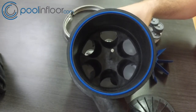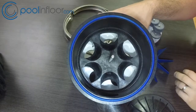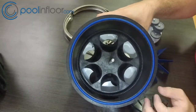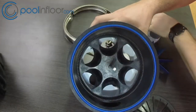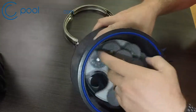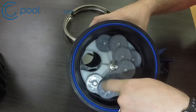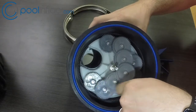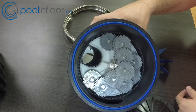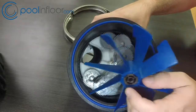It's pretty straightforward and very simple. As you can see the bottom — some other valves have different ways of getting water through to the ports, but these actually have slopes, which are really cool. When the cassette is installed, there's nothing that has to be pushed up or moved to the side for water to get through. Every time the cassette turns to a port, water just pushes down and into that port — a very simplistic and awesome design.